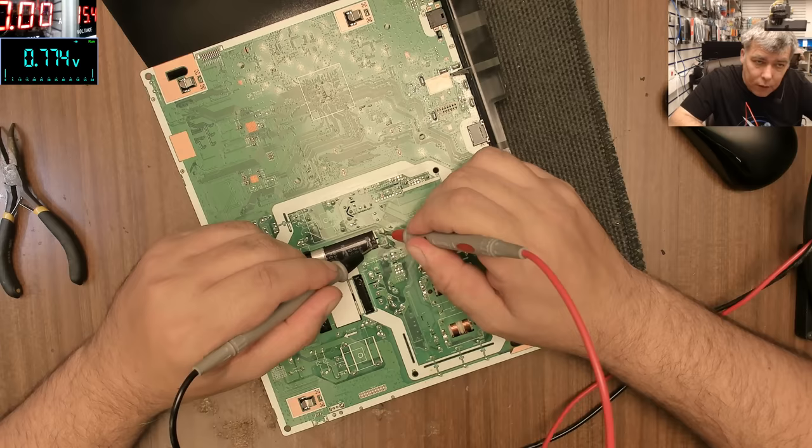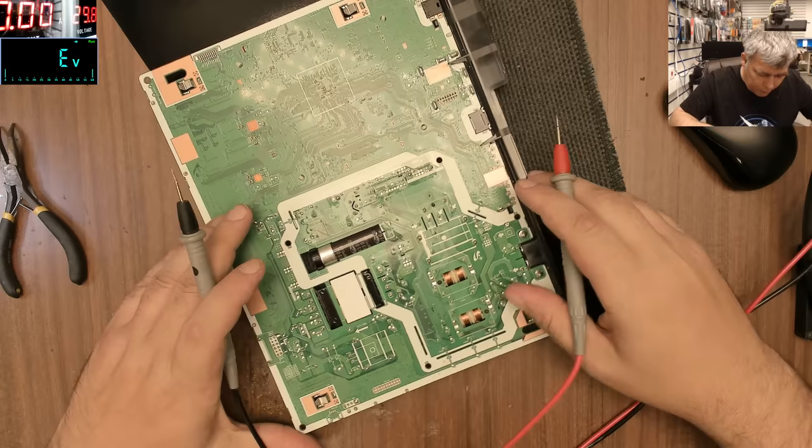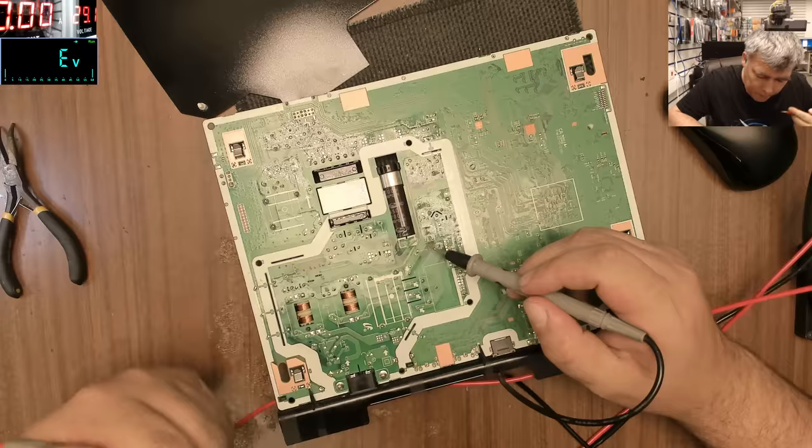What I will do, I'll take the power supply, because the multimeter has 5 volts, but the power supply has 13, 30. And I will come with the power supply on the rectifier bridge, minus plus. And it's no short. Okay, now I will jump with the power supply. I will keep the ground here. And I will jump straight to the plus of the capacitor,